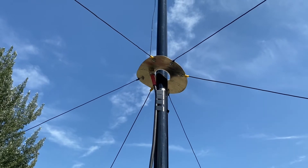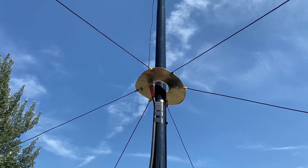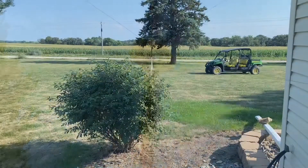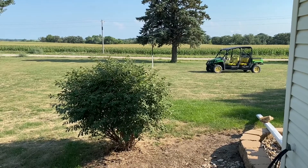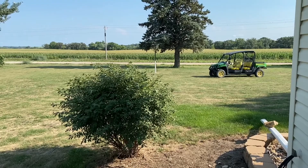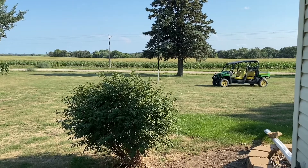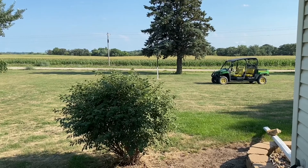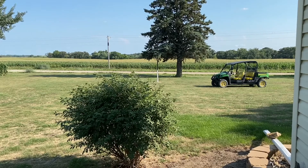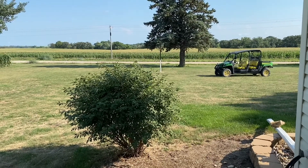The tape and the coax are actually supporting and helping hold up the tension so it's not hanging on the wire. I'm using 100 feet of RG8U coax cable to get down to the antenna, and that has a 0.98 dB loss per 100 feet on that cable, so I'm losing about a dB - which kind of sucks but that's ham radio.